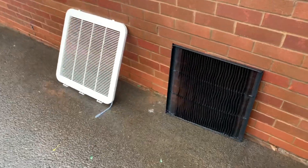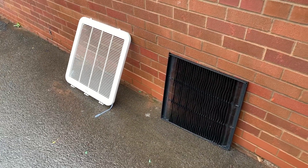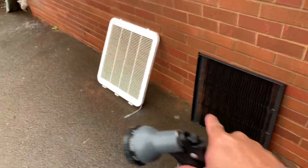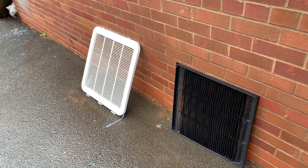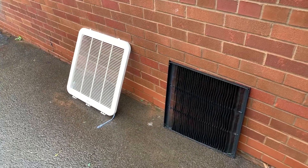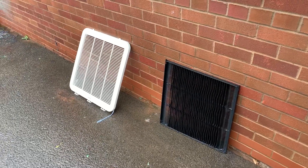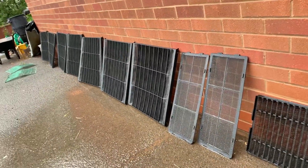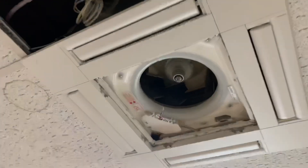There's no right or wrong way of doing this — some people like to use a vacuum, some people like to use a brush. This is just the way I personally prefer. If you've got a water source, I just find it quicker and it leaves a much better finish — there's absolutely no dirt left on this now. I've blasted it with mild disinfectant. These filters can't catch viruses — they're not HEPA filters — but they still harbour a lot of crap, so it's nice to give them a wash wherever you can, and it genuinely doesn't take that long. Try cleaning one with a vacuum and you find yourself sitting there for ages.